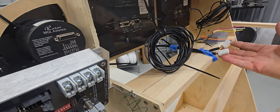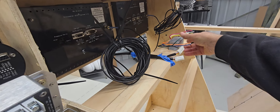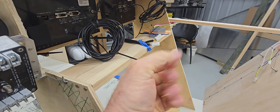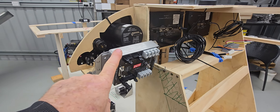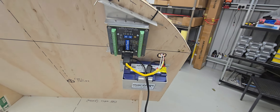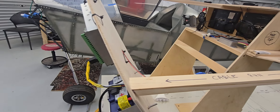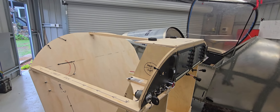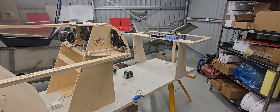There's the ECB just sitting here. Everything is in its spot now. I've got the two GPS aerials connected. Here's the part of the heated seats that come through. This is the wig-wag lighting control for the landing lights — for those who may not know what a wig-wag is, it just allows the lights to flash on and off, acting as a warning device to scare birds away so you don't have bird strikes. Working my way through to the firewall, I've got the RDAC, and I've just sat the battery in at the moment. I've still got to put in bus bars and many other things, so this is just stage one of the jig.